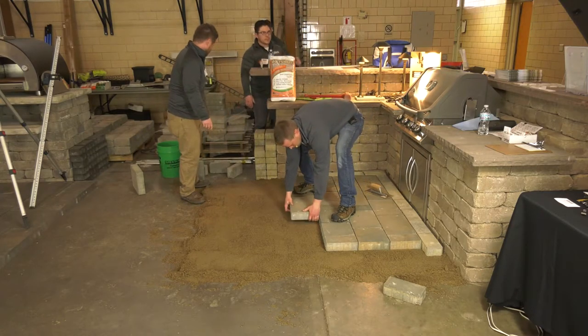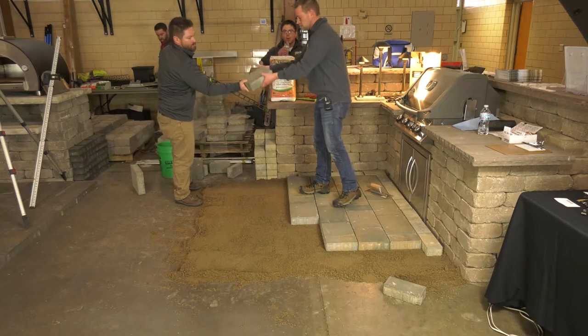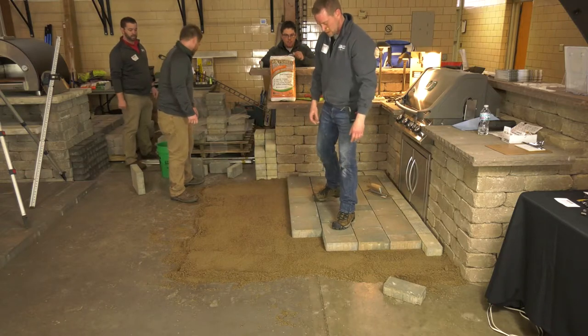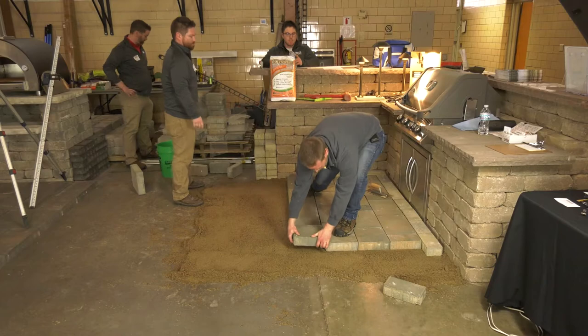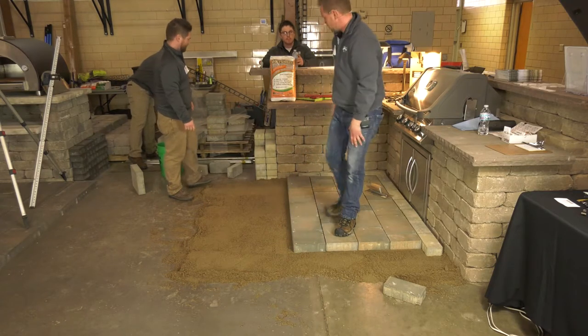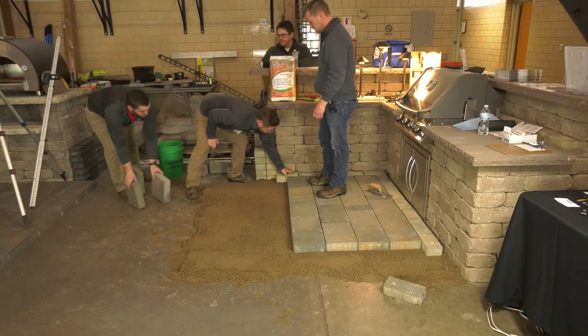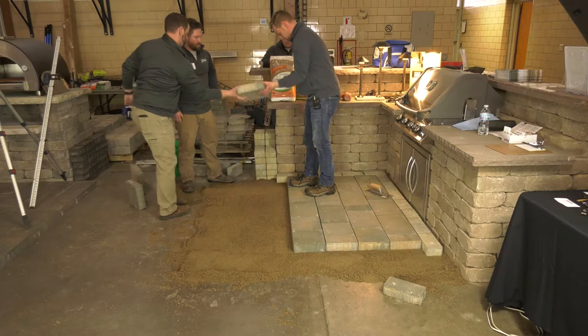One thing too, just with the slate stone, because all the pieces are on one pallet, what we should do, obviously this is just a little test area, yeah. But if this is a big patio, we want to use multiple pallets at a time, right? Because the color mix goes vertical from top to bottom as you start to go through the pallet. We can do obviously one more row. Using multiple pallets